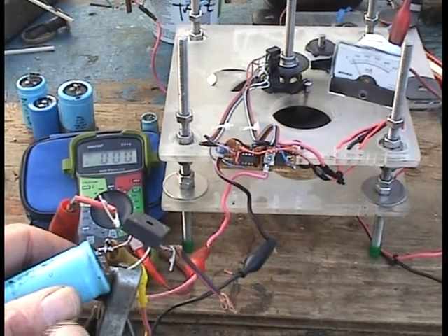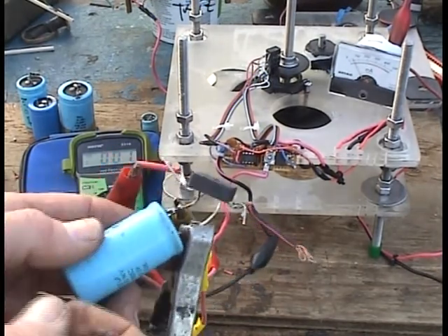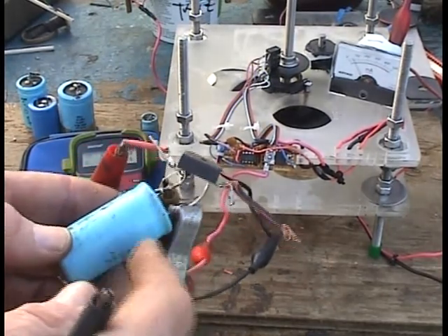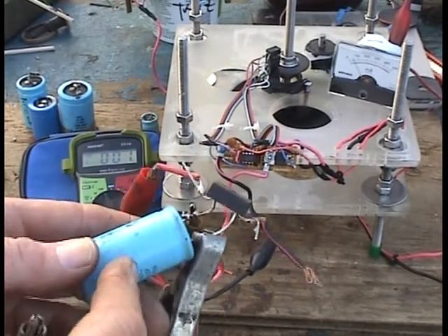When you tune your discharge of the cap to your load — like charging a battery or whatever you're doing — you have to decide how far down you want this cap to go, or have the system decide for you. How much voltage do you want in your cap? That will be dependent on the UF value of the cap.